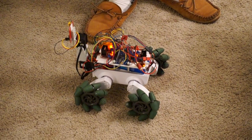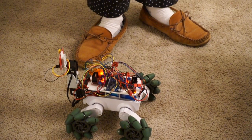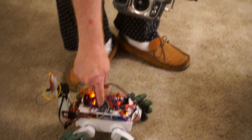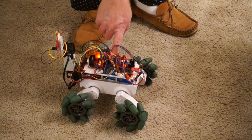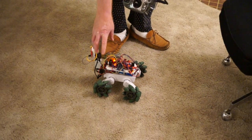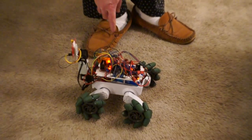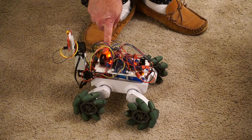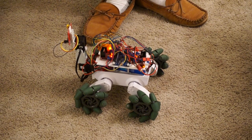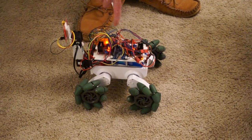Right now I'm using a 7-channel Spectrum radio, although the receiver is a HobbyKing 6-channel receiver, and I'm using a Quickstart board as the controller — the brains. The Quickstart board has a propeller chip and there's eight encoder lines coming into the propeller chip, six radio control lines, and I think there's twelve motor control lines. So I'm really running out of pins on the propeller.